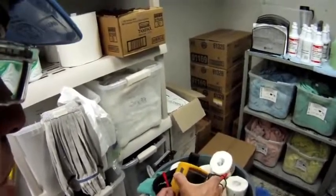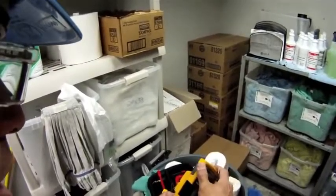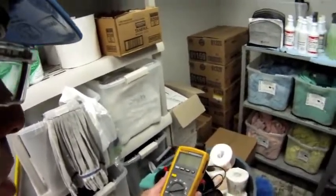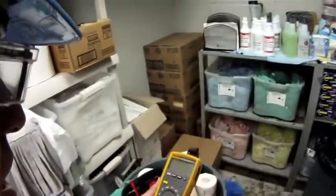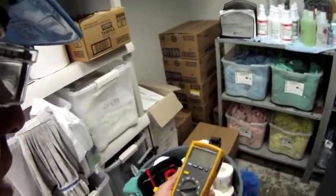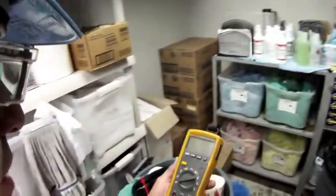This particular meter also has a removable display. Because of that removable display, I'm not wearing FR gear today — I'm not wearing my fire resistant gear. All I have are my safety glasses and good practices. I'm going to check the amp draw in this unit while it's live and running, and I'm going to do it completely safe.